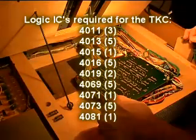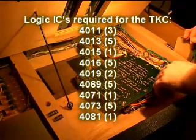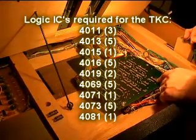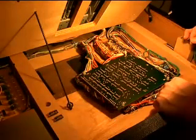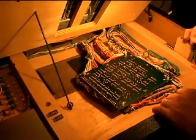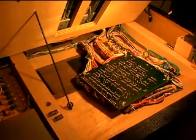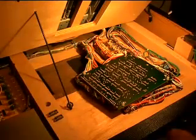Just to keep from making a mistake, I'm going to do one chip at a time — unsolder the chip, solder in the socket, and install the new chip as I move on down the line. I have a static-grounded soldering iron so there won't be any problems with damaging the board. Plus the new CMOS chips are protected against static much better than the old ones. The new devices should have an expected lifespan of anywhere from 100 to 200 to thousands of years — very reliable versus the old product.